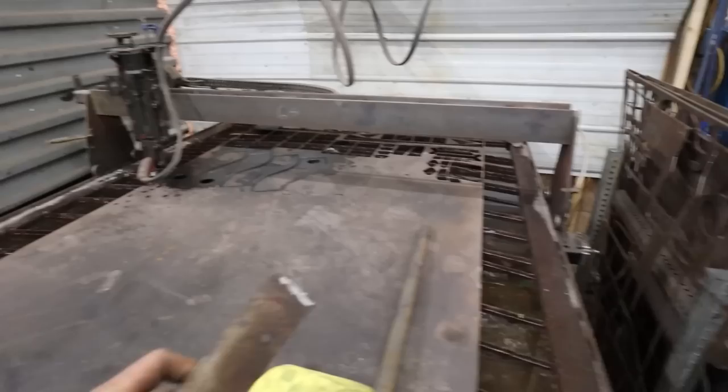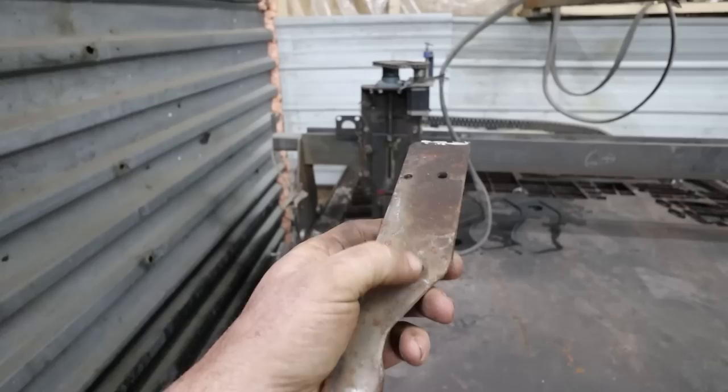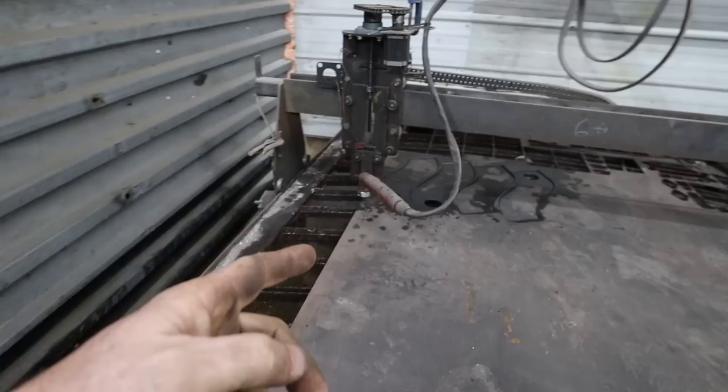I was today years old when I learned I had this plate welded onto that doodad, and I had my plasma torch zip tied onto there. I decided to get a collet and properly put my torch head on there, but I guess it's not low enough. So that's why you've seen me keep tapping my torch to hit my limiting switch so I can actually do my cuts.